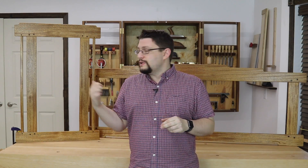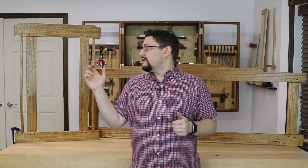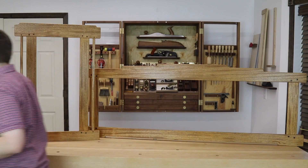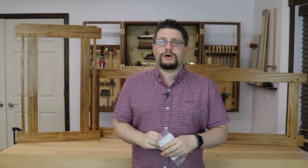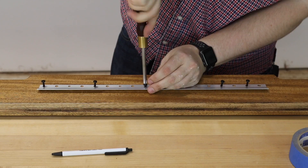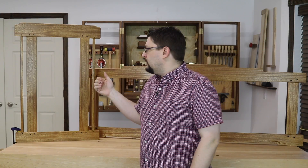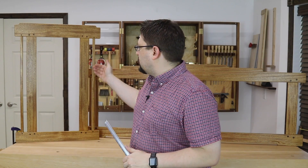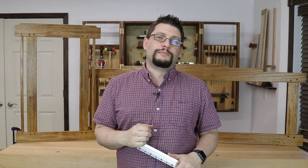Cross our fingers — just waiting for that to ship, and then I can get these guys hung on the wall. I've got the hanging hardware installed. I bought some Hangman hardware from Rockler. They have a 6-inch and an 18-inch bar — I did the 18-inch on the big frame and the 6-inch on the smaller one. Once the glass and picture come in, I need to mill up some material and create holders for the glass and the frame and get those nailed into the inside edges all around, but I can't do any of that until the glass or picture arrives.